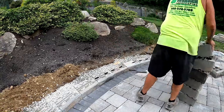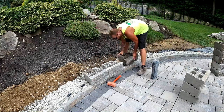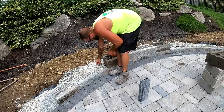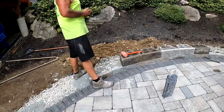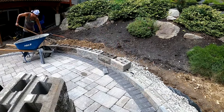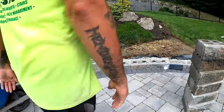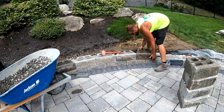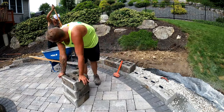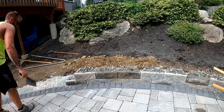A quick note about these tabs that interlock each layer together — I know a lot of you who use this system don't generally use those on small walls. But the way I see it, in any application these things are going to do nothing but help. Some people say they're pointless, but when you build a wall like this and put those tabs in, you can try to kick the wall over as much as you want — those blocks aren't going anywhere. Without them, you can take any hammer to the back of a block and shift it right out. These interlocking plastic tabs are designed to prevent that, so make sure you use them.